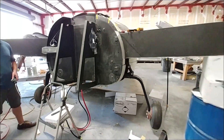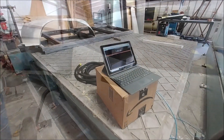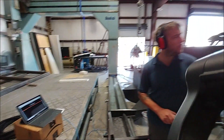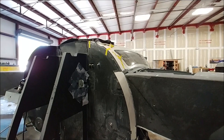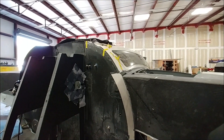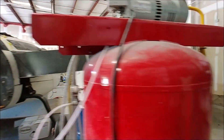We're both standing behind there in case something blows up. I walk out fairly quickly and we didn't actually hear any creaks or groans at this point - everything was very quiet. The minor leaks happening in the parachute strap area don't make any sound. There we are at 2.3 now and still moving up. We took it to every half PSI and let it stabilize, then checked for anything. Tape was blowing around because of a fan off behind us blowing cool air - it was about 95 degrees in the shop.